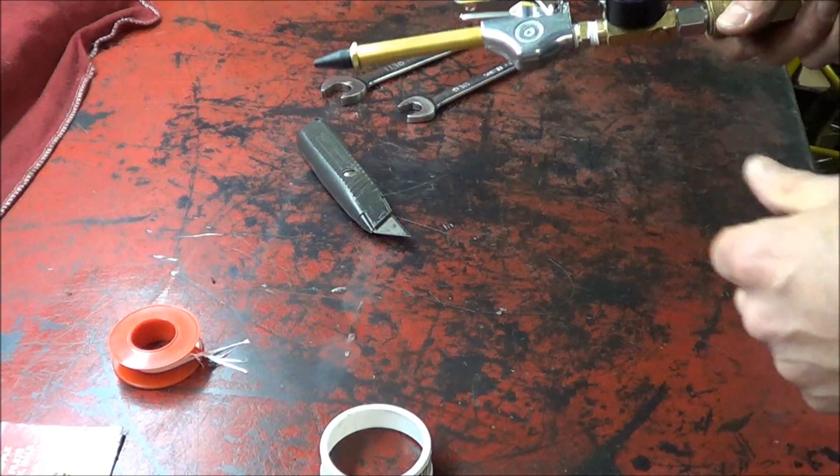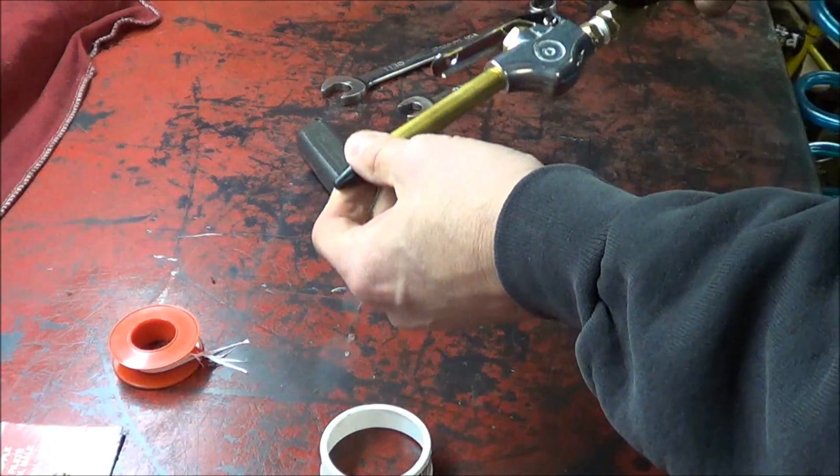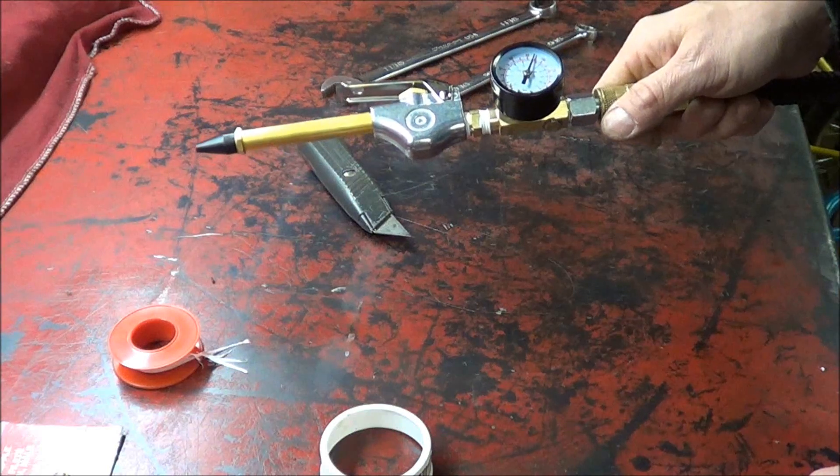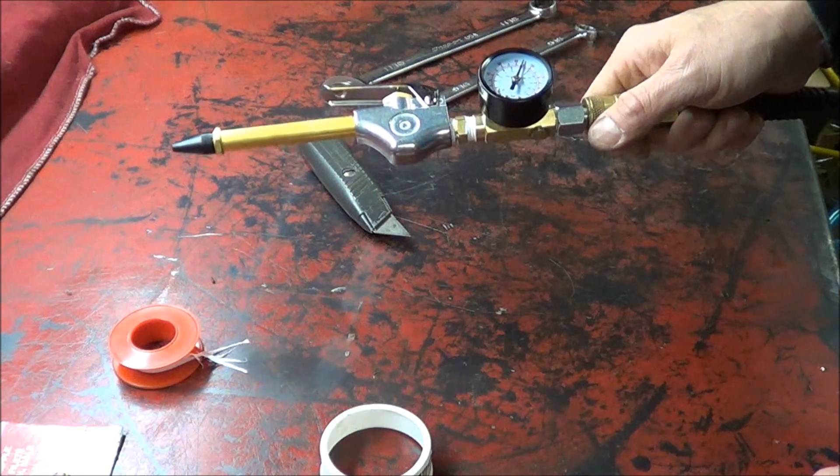So there you go. I wonder how this will work on a clutch pack — I guess the next transmission that I do, we can test this out on. Thanks for watching. After I got the tool assembled, I thought about it and realized that the air flowing through the tool is only regulated as long as the flow is unobstructed. If you deadhead the tool when there's air going through it, the pressure would basically go back up to shop pressure — it kind of defeated the purpose of the regulation.